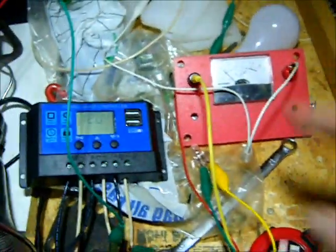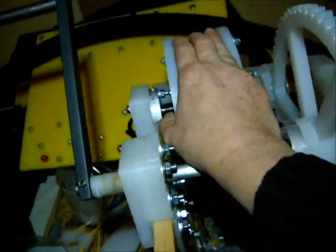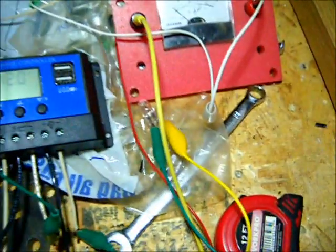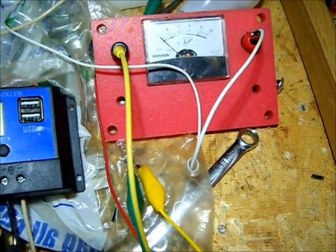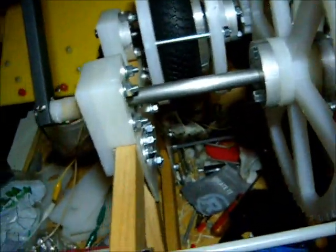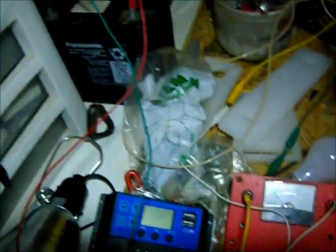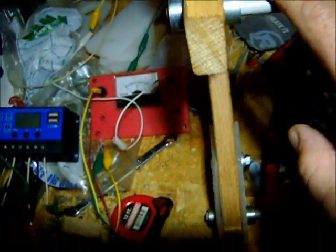That was about 2 amps, and the no-load voltage at that RPM was approximately 20 volts. So 2 amps, 20 volts with this load. Man, that doesn't seem right. I'm going to stick with calling this a 50-watt HandCrank generator. We'll post more results in the future. Thanks for watching. Enjoy the day.